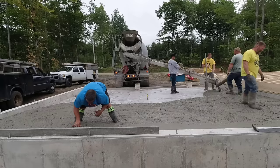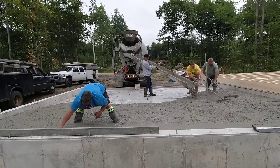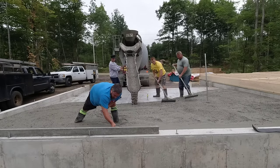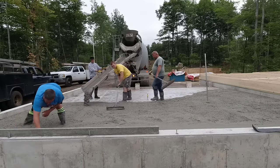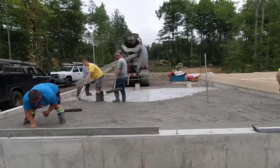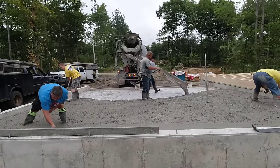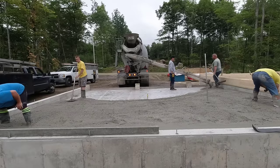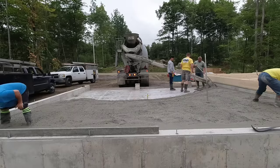In a garage this size — this was 26 by 24 — we'll pour like 90% of the concrete right out, just leave a little hole at the end in case we're high and we can pull it into that hole. We're using that little pin in the middle — that's a grade pin from Crete Pin Pro, sent us a box of about 10 or 12. It's basically a piece of half-inch rebar with a yellow grade piece that goes over it and has a set pin on it. You set it with a laser, tighten it up with the set pin, and use that to go by as you pour, giving you an idea of where grade is right in the middle.